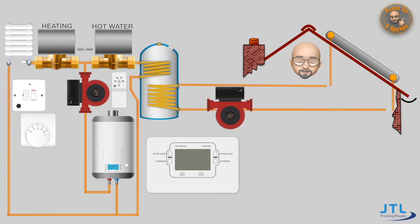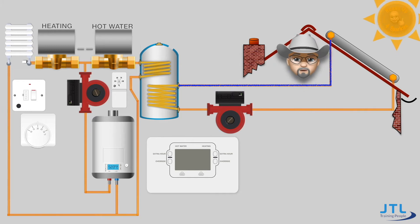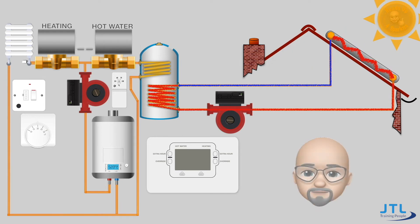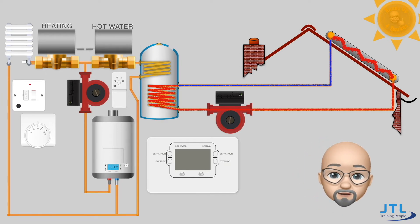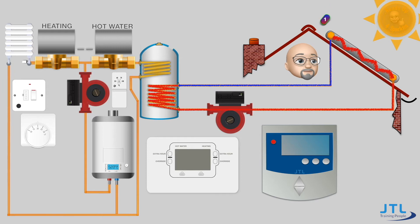Let's get that installed. Here we have a conventional roof — on the south-facing side we fit the collector, and this is plumbed directly to the heating coil in the hot water tank by a pump. The sun comes out and warms the water in the collector, then the pump circulates the hot water through the heating coil in the hot water tank. Of course, this should only operate when there's hot water available to benefit the system.